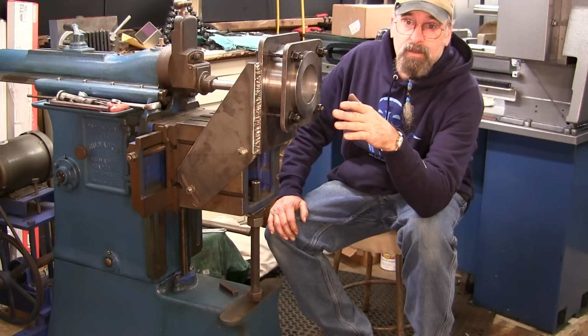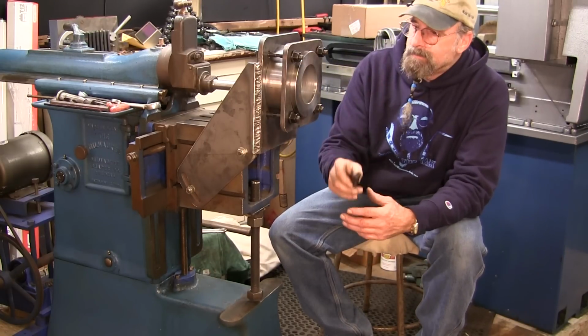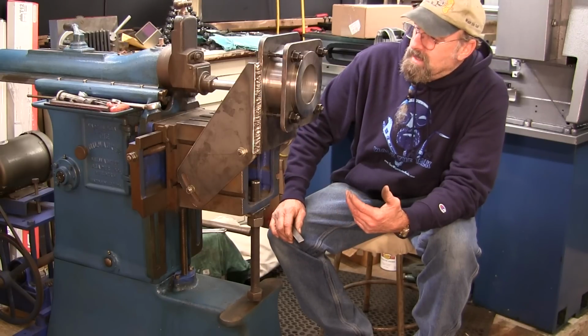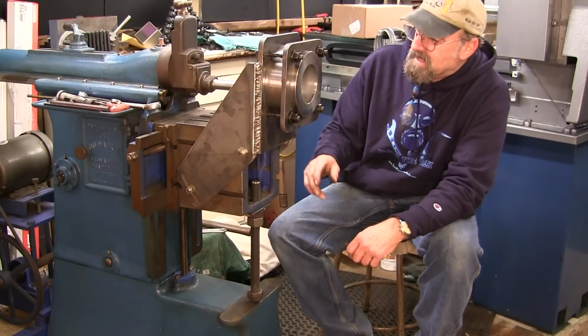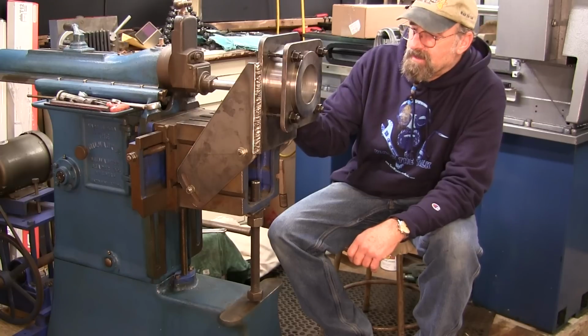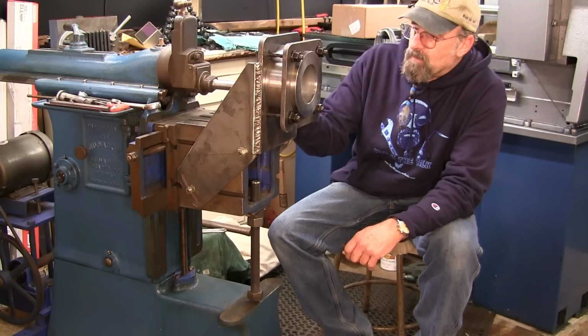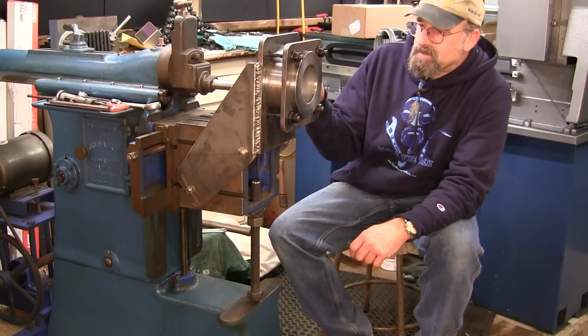I didn't have a 3/4 inch broach. That's the width of the key that we're putting in. So having this already here and set up, it was a short time, especially with the plasma cam. We were able to go ahead and cut out a resting support or holding support for this hub, and it lets us tilt it, and we're getting ready.